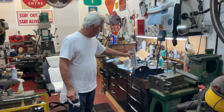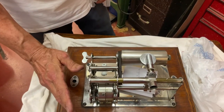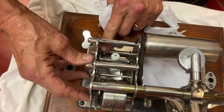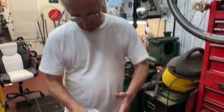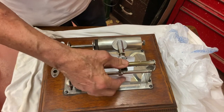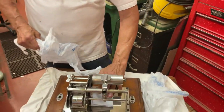And that will protect the machine and the reproducer. You want to first make sure when you tell people you want to ship the phonograph to you, you make sure it's totally run down. This right here — you'll see this move on my finger — that's the brake off, that's the brake on. I want the brake off. If there's any tension left in the spring and it wants to let go, I want everything to be able to spin freely. I want slack in the motor and the carriage because I'm going to lock the carriage in place. I put the winding key in here — that can just float in there.